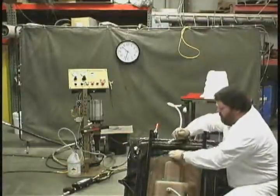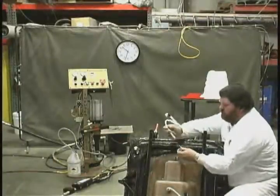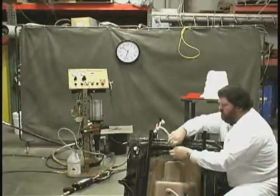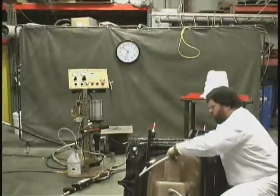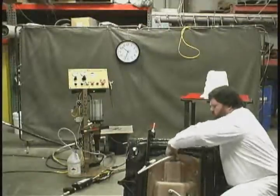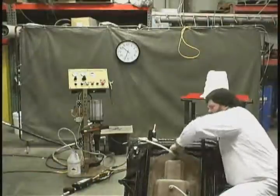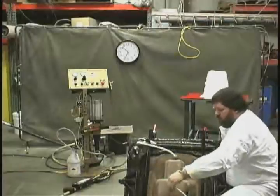Now what he'll do is insert the injection tube — the tube that will communicate the resin into the mold during injection. We'll simply pinch that tube off at the end, allow the resin to cure, and then pull the tube out. That's the disposable injection sprue — a very cost-effective way to connect the mix head to the mold with an easy-to-clean injection sprue. That too is inserted through the injection sleeve until it's flush on the inside of the mold. Don's right hand there is feeling on the inside to confirm the end of the tube is flush with the top of the mold.